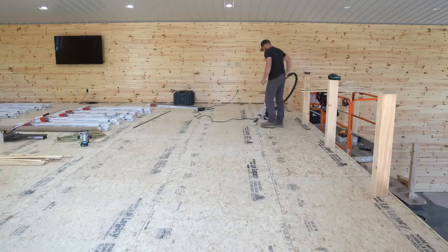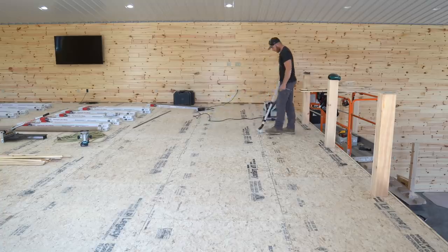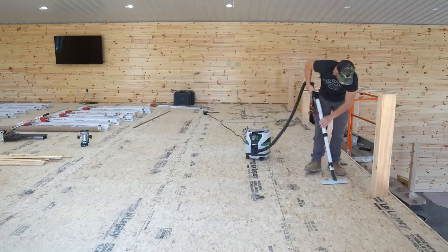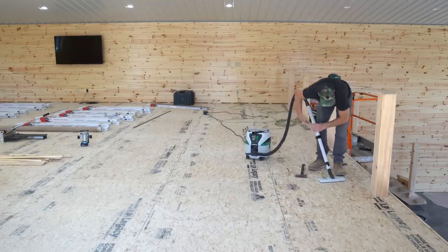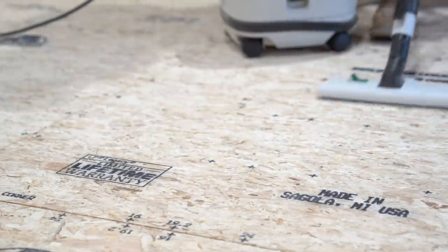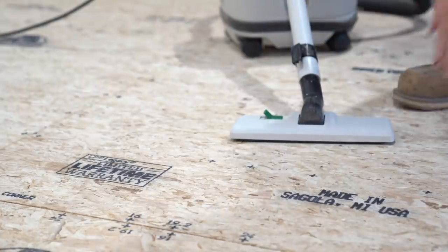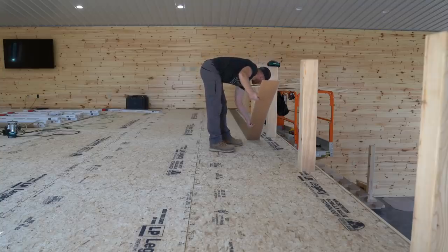So no matter what type of flooring you're going to be installing, you always want to make sure you prep the surface. The material we're using, which is the COREtec Pro Series, doesn't require any padding or under vapor barrier, especially since we're not installing on top of concrete. I'll be able to install it right on top of this wood floor. So my first step is prepping the floor by cleaning it and checking for any nails that are proud and making sure that they're pounded in.